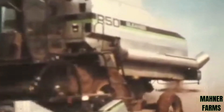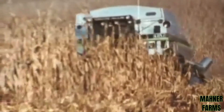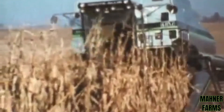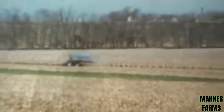All major components are placed for even weight distribution, so you can expect uniform traction and better flotation. We built in even more flotation with a new high-strength frame — using an extra-strong grade of steel, we built a lighter frame that lets you move through muddy fields with more confidence than ever. Since this is a one-piece all-welded frame, you won't have to worry about it shaking loose and throwing other parts out of alignment. With hydro-traction drive, standard on the R50, you'll be able to gauge your ground speed exactly to match conditions. You have your choice of two final drive types, with optional wheel spacers for changing tread widths and dual tires. And with this new size rotary, you'll have an improved turning radius of just 20 and a half feet. A two-speed vari-flow spreader lets you adjust straw or stalk distribution to match the width of your header — a real plus for conservation tillage.